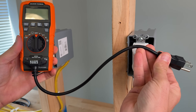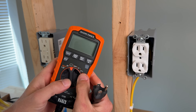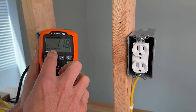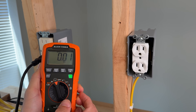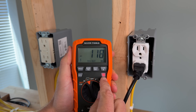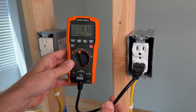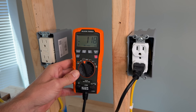This is the ET270, which is kind of a combination of outlet tester and multimeter in one. The ET270 comes with a convenient pigtail that plugs right into your standard multimeter inputs, and then you can turn it over to the outlet test feature. Plug that into our correctly wired GFCI — we got a green light confirming correct, and we're getting our voltage readout. We can go ahead and trip it, and just like the RT250, we get the response time on this unit. Testing it with reversed hot and neutral, we have that light turning red showing a fault, and then the display shows hot and neutral reversed. It's pretty handy that this comes built in with overall similar capability to the RT250.